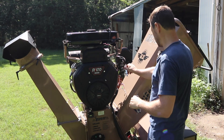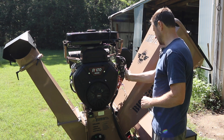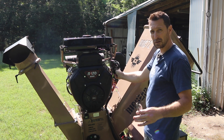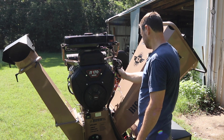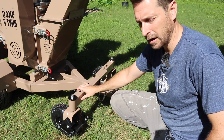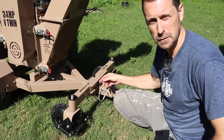Let's fire this thing up. We got spark — I tested that earlier, choked it out. This is the throttle; it's a hand-operated throttle. It would have started if I kept going — it would have started on the first fire. When you're using the chipper, these front wheels need to be down, and this wheel does have a lock on it which is nice, so it's not going to roll anywhere. For towing, we need to flip this back and engage those two pins.